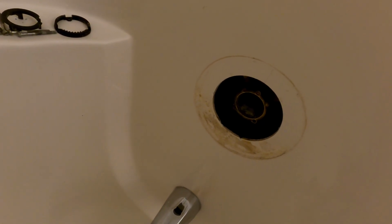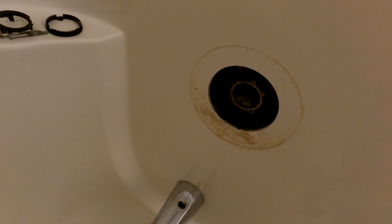Usually whistling comes from the tub spout. So after I did that, I knew it was a cartridge. The cartridge is in horrible shape. I wasn't really too comfortable since I hadn't really done American Standard before. But I mean, these hardware stores all have them in stock. No problem. So I started digging into it. Took it all out. Kind of gouged where the seal went.